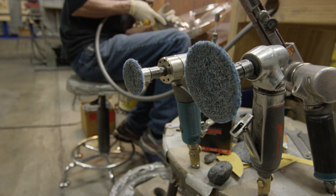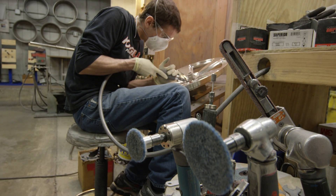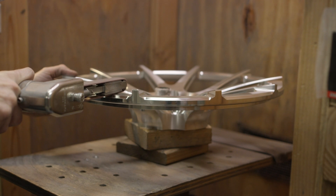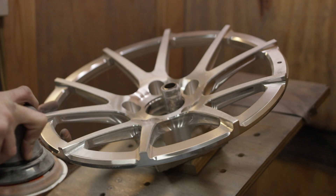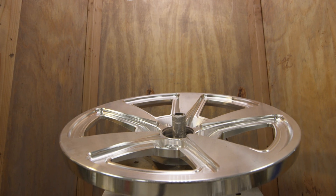After that we'll go into the grinding room, and those guys are inspecting the part looking for defects — which there are very few — but they're going to inspect 100% of the part. They're going to grind out any kind of imperfections and burrs that might be hanging on from especially the drill part of the machine, and then they're going to prep that for powder coating. They're going to either brush it for a clear or transparent powder coat, or they're going to sandblast it and get it ready for a solid tone powder coat.